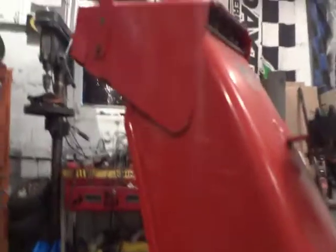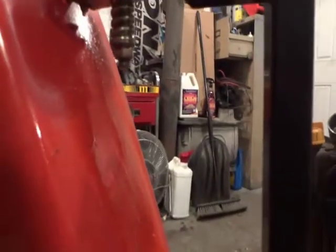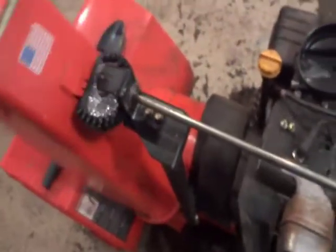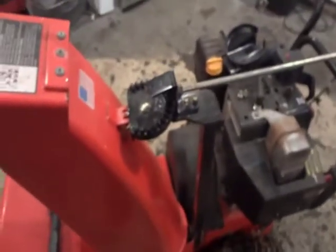It's actually just a little bit, it's this little adjustment bolt down the bottom here. This adds tension to the top there. This guy here wouldn't move when the snow was coming out, but this was actually over tightened. So that wasn't too good, but I got it all fixed up. No more squeaky squeak. It was just a little bit way too tight on there. That's what was causing the problem.